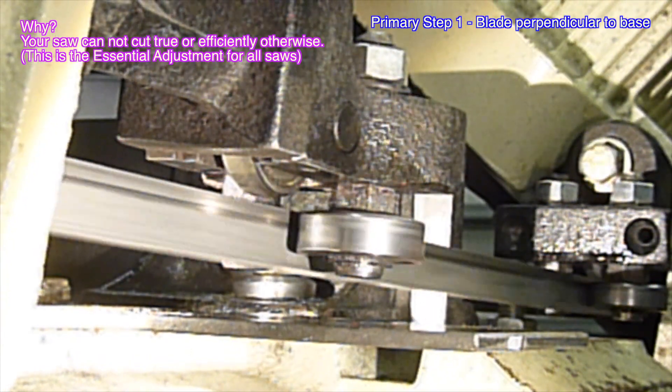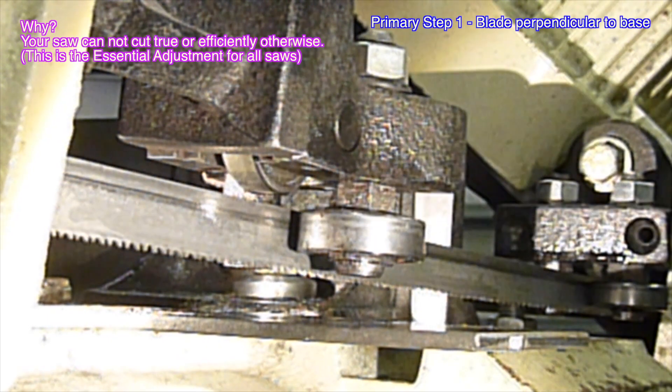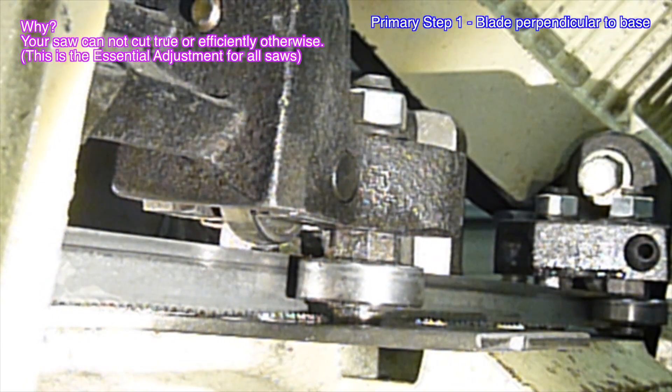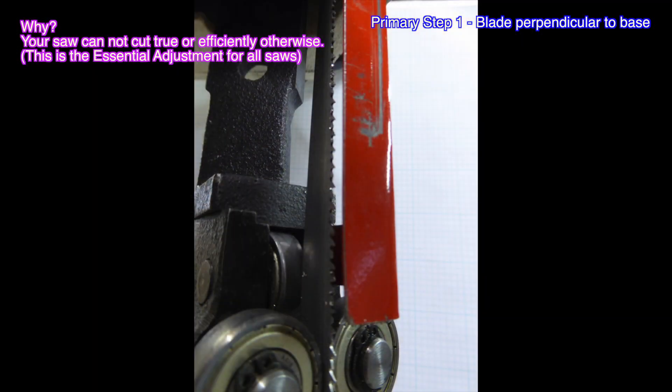This is just how easy it is to make the most exacting adjustment on the saw accurately. Initially I thought perhaps I would need to bias the settings against the pushback by the blade, but it turns out that the bearings are so effective at twisting the blade that a bias is not necessary.